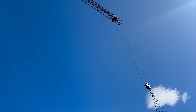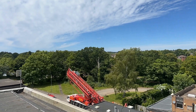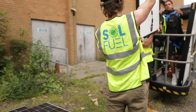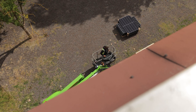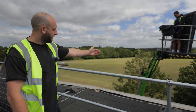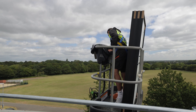In order to get the gear up here, we've got a crane to lift all the mounting equipment up, but unfortunately we weren't able to use the crane to load the panels up here, because the weight bearing capacity of the roof isn't suitable to just drop a pallet of panels off — 600 kilos or whatnot. This was the safest way we could think of doing it: cherry picker. Because we've got this full arrest system around here, a scissor lift wouldn't have really been any good as we'd have had to cross this to get to it. Whereas with the cherry picker, we can only do six panels at a time because of the weight it can take — we plunk them on the roof over here so we haven't got to cross this, we can just grab them and we're off. And that way we can spread the panels out so we're not breaching any of the structural engineer's weight limits.